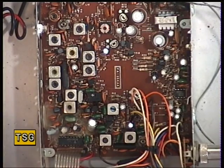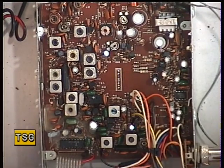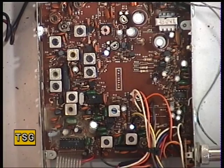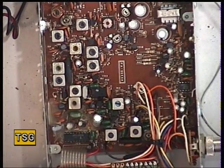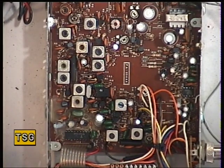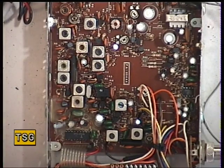Hello and welcome back to the Uniden Uni-S100 video. This time we're on to the receive — we've just covered the transmit. On receive, our first thing to adjust is coil L6. First we just need to make sure we've actually got receive. At the moment the receive is pretty poor on this, which is probably why it's been sitting on a bench for about two years.